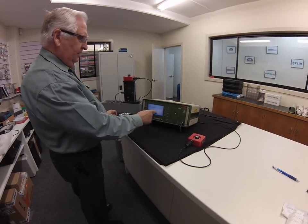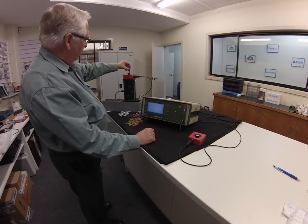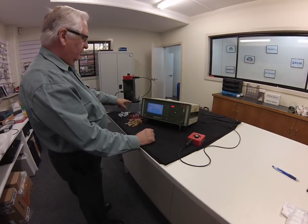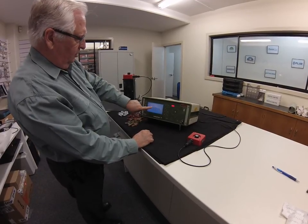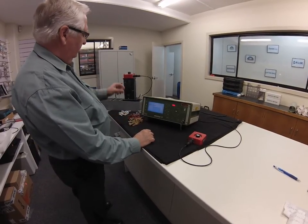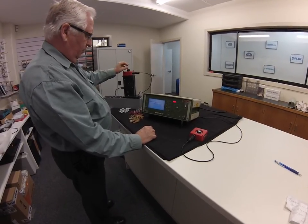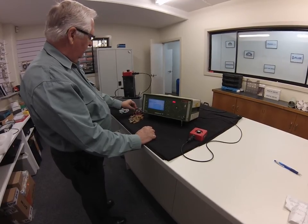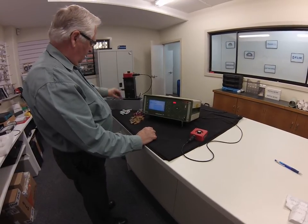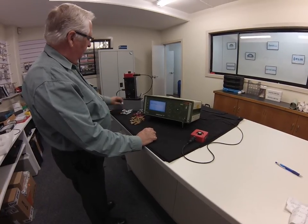The line comes down here and the green light comes on. We put a defective component in, goes the other way through the sort gate, red light, and you can see that this has gone up into the reject area for each of the frequencies that we're using. We use these other ones, so we get a total reject on all of those. We put a good bolt in, comes back down.